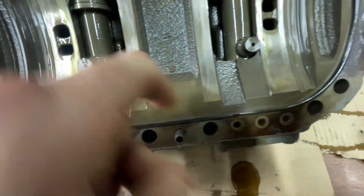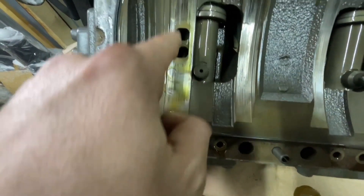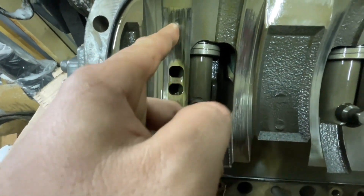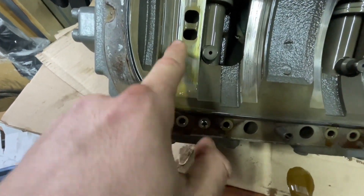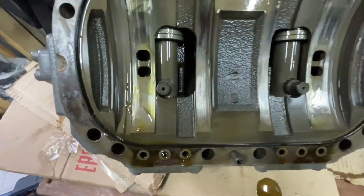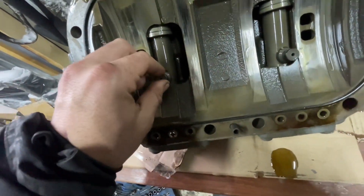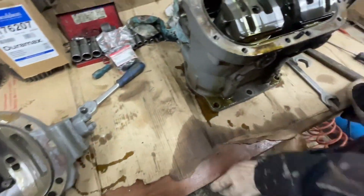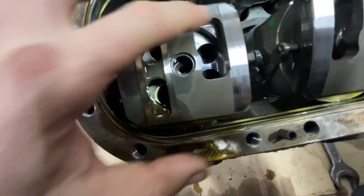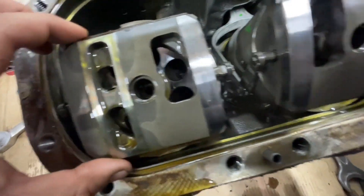Then we'll open it up completely and defect it. Let's see how everything's doing. Of course, if there are scuffs on the cover, they will also be present on the camshafts. Let's see how they fit with the rotor. I don't see anything critical yet. Let's check the pistons. I see some shavings over here. The feet are kind of weird — the castings are sharp.